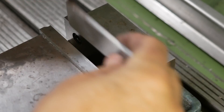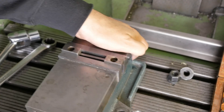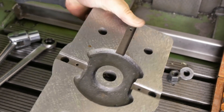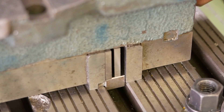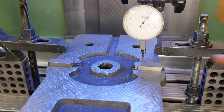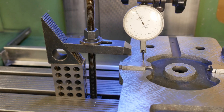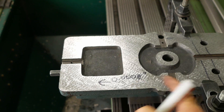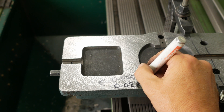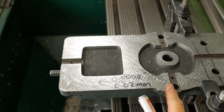To do that check I'll just grip the two keystones. Now when I flip it, it's accurately aligned into the slots. Those keystones are like gauge blocks — absolutely no movement there other than tilting it forward to back. With the whole thing strapped down securely and gauge blocks filling out each of the slots, let's see whether they're parallel. I've got about eight ten-thousandths of an inch in this direction relative to the other one — that's about two one-hundredths of a millimetre. Since I have to widen the slot by five one-hundredths of a millimetre, if I'm careful with my touch-off I should be able to fix that.